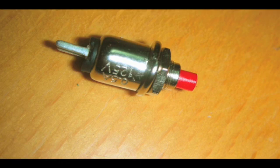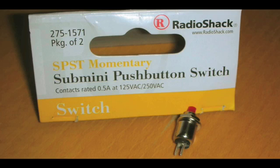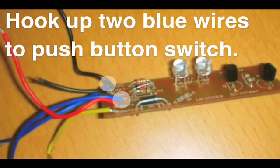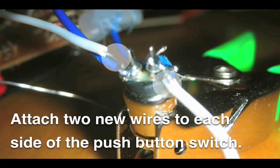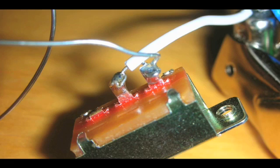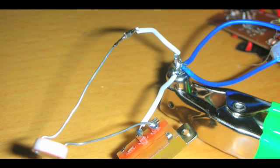There is one last thing we would like to add: a switch to make it so that the light can be controlled either manually or by the photoresistor, which is used to brighten the light when it becomes darker. To make this happen, we will need to insert a mini push-button switch and another mini slide switch, along with two wires and the photoresistor. In the finished project, the push-button switch will remain inside the Altoids tin, because we are only going to be using it to hook up to the other mini slide switch. Hook the two blue wires on the circuit board to the push-button switch and add two new wires attached to either side of the switch. With one side of the slide switch, attach a side of the photoresistor to it. With the other side of the push-button switch, solder one of the white wires to the slide switch and attach the other white wire to the unsoldered end of the photoresistor. That's it for the inside.